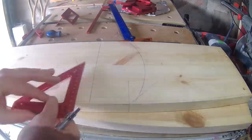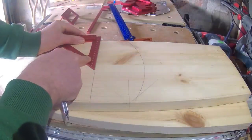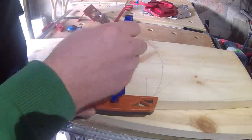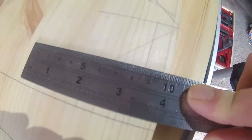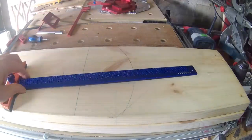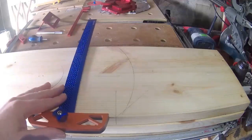I found the face of the stock and the sides of the blade to have been machined flat and true along their length. Doing a line and checking with a couple of different squares — all good. I do a line using the hole at 100 millimeters; I used a 0.75mm pencil in the 1mm holes but the line is surprisingly accurate. Despite the need to square it on arrival, it is a nice tool and given its length will definitely come in handy for layout on boards. Do wish it was more clearly marked though.